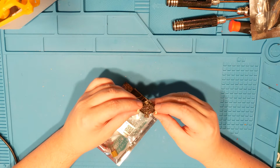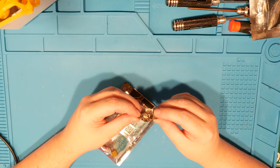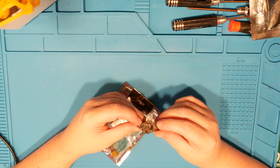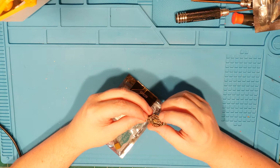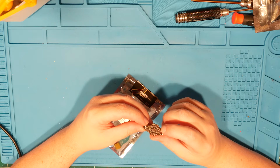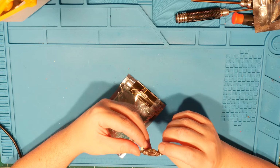So this is the all-in-one that I was thinking about using, and I was actually considering removing these connectors and coming off the battery, but it does have an R2 and a T2 pad, which I hope are uninverted pads, and I can power the DJI unit directly from the battery. There's no problem with that. And then there's also an S-bus here somewhere, or at least I thought there was. There's a pad here somewhere for S-bus input. Maybe it's RC.